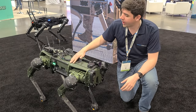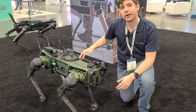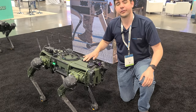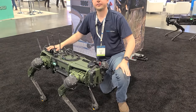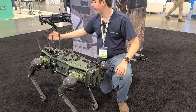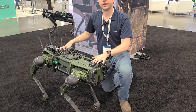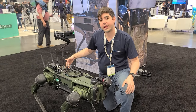On top of the robot, there's a wide array of mounting holes and rail systems — including Picatinny rails and other rail mounts — that support a wide variety of payloads with quick-release capabilities. These rails are standard across the DoD, so they're incorporated into the base design. The robot is comms-agnostic: out of the box there's no radio, but there are Wi-Fi and LTE antennas, and the onboard router can use cell or Wi-Fi signals to command the robot. If you want to attach an external radio, you can plug it straight into any of the three Ethernet ports on top.